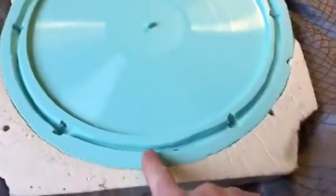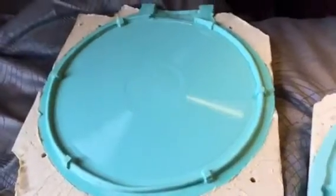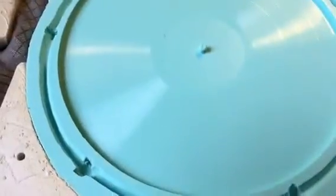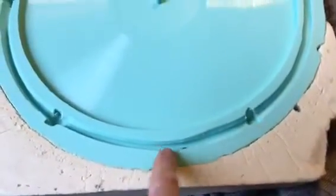Those bolts have been removed because you probably know what a bolt looks like by this point. Here's the inside. The different mold halves are keyed, and this keyway also serves two purposes: it locks the two halves exactly in place, and this particular design also acts as a gasket. So when this is all bolted together and those bolts are nice and tight, this creates a gasket to keep the urethane resin from leaking through.